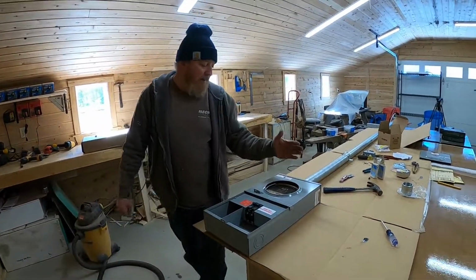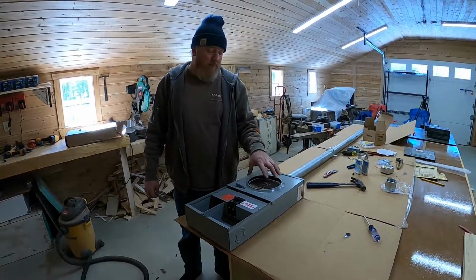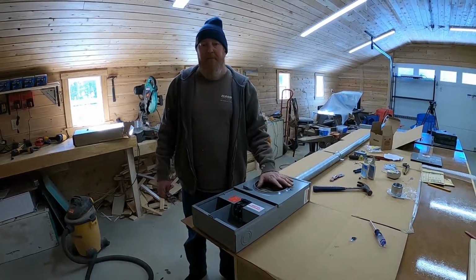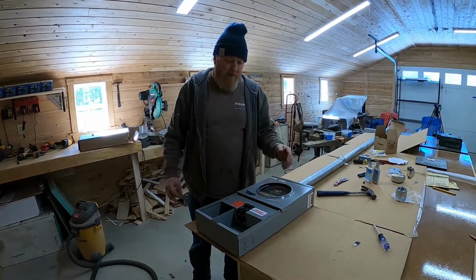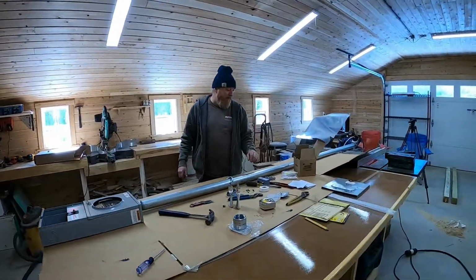And then we basically have to shoot for between 4 and 5 feet to the top of the meter can, the actual meter hole here, not the can, for the utility reader to be able to read it, even though they don't read them anymore, they're all electronic. So that's really it. It's a pretty straightforward process.